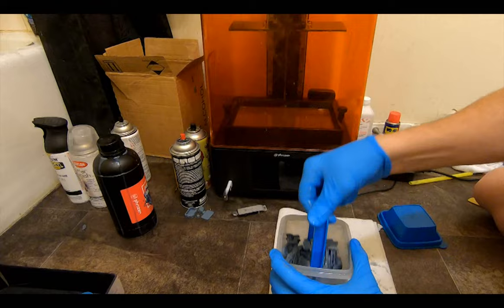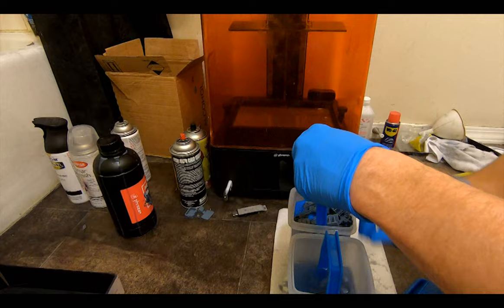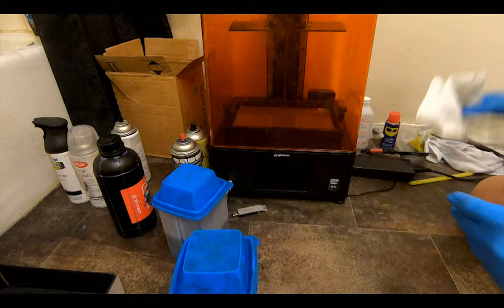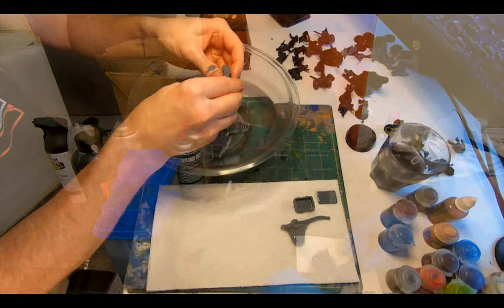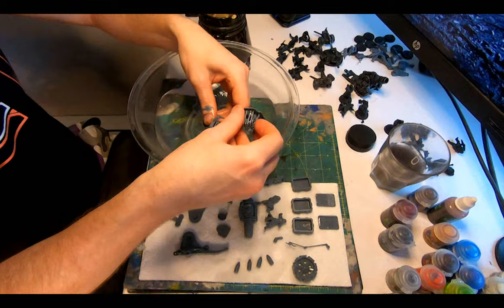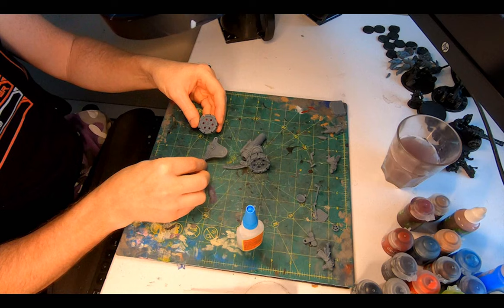It has been suggested I should use my fingers because using the scraper causes wear and tear on the vat, but I'm not leaning into it particularly heavy — just dancing it across. I did try using my gloved fingers but that still missed some bits; my fingertips just ain't that dainty. Then get everything into the alcohol, agitate and plunge to clean them up and get the slime off. After extracting and leaving to dry for a little bit, into warm water they go, and they detached very nicely from the supports with not much cleanup afterwards.